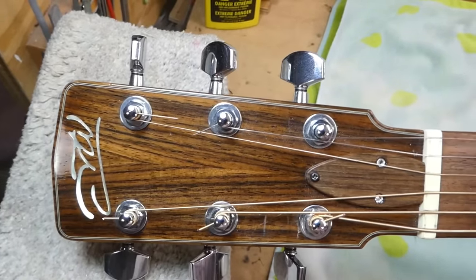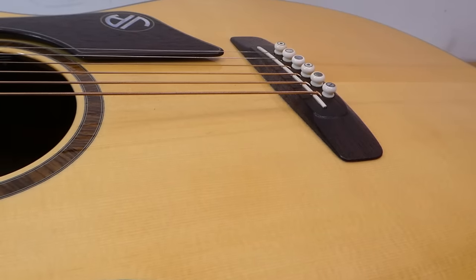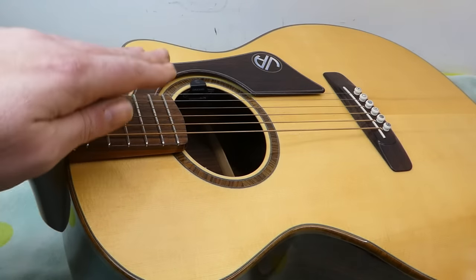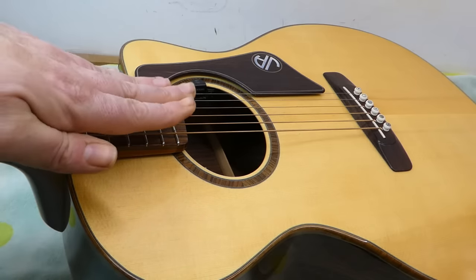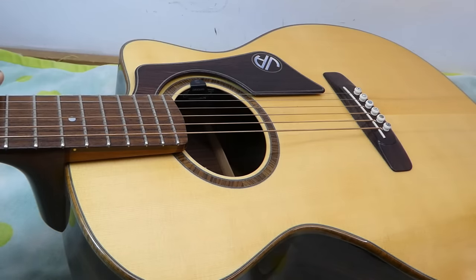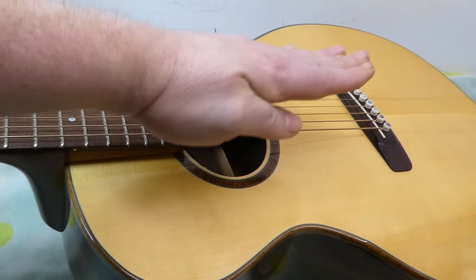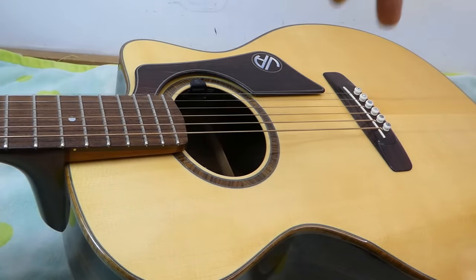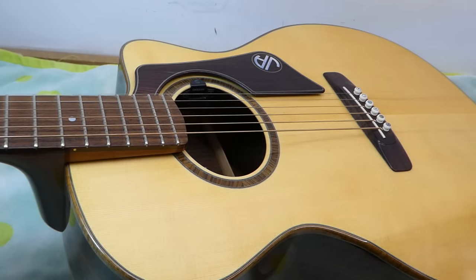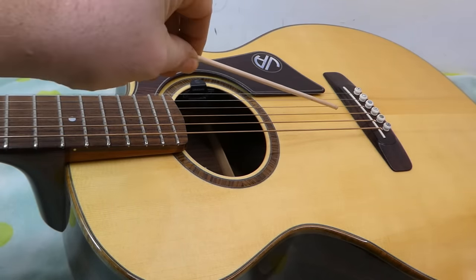It's a nice tight little headstock. The reason this guitar is here is there's very little saddle left. In my experience, this is not uncommon in flat top instruments with raised fingerboard extensions. You wouldn't think it'd be such an issue, as the rotational forces on the top might be reduced by not having the end of the board pressing down on it. However, there is a different geometry at play from having the strings so high above the body joint - the neck is aligned away from the player, so the strings meet the bridge at a downward angle rather than an upward one.